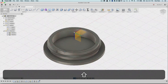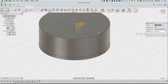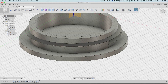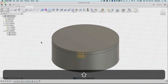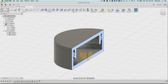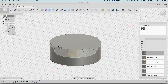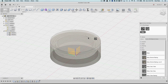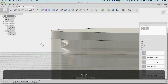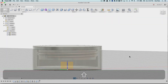I can do a chamfer here — double-click on that feature and add this edge to it, so I don't have to keep adding separate chamfer features. That's it. If you want to see through it you've got section analysis, but I'll apply a physical material — glass — drop it in there. Maybe the top doesn't need to be see-through, but now you can see how the coil wraps around itself, with a little clearance area. It is going to be 3D printed so you do want a tiny bit of clearance, as I showed you. Pretty cool — it works out really well, I've tested it quite a bit.